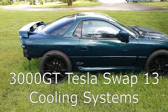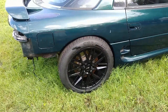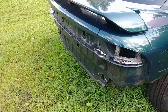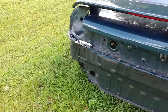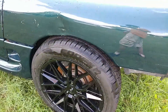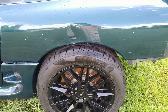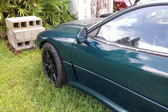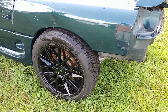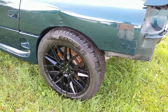This video will be mostly about cooling work, but I figured I should mention that I've increased the suspension preload a little bit, mostly for the purpose of rolling the car around the yard. Previously these wheels back here were where the car was resting on its fenders, so it was more or less totally locked up at least in the rear. I'll have to add more obviously because the rear battery pack isn't even close to being in, so that'll add quite a lot of weight in the back.